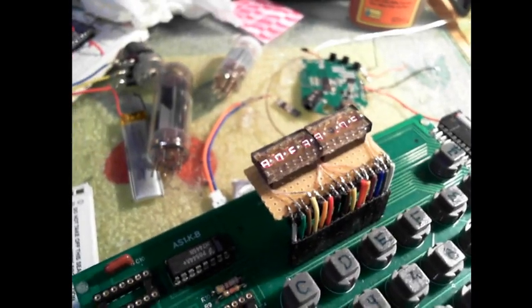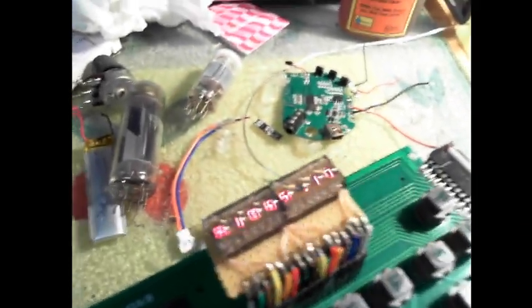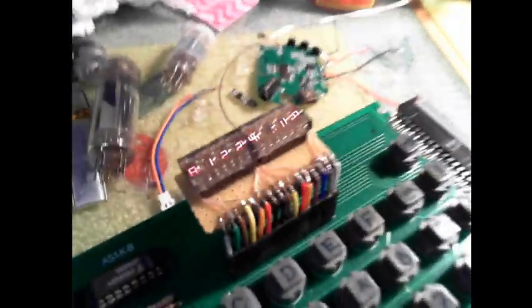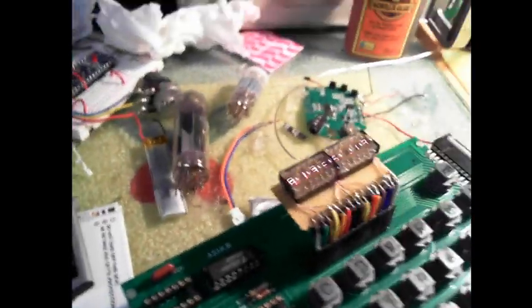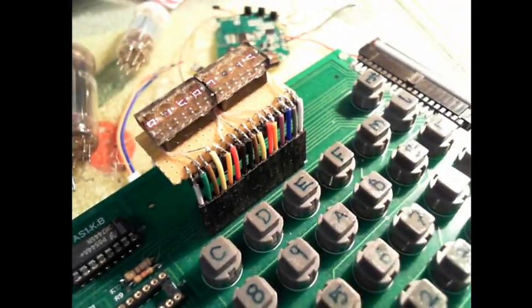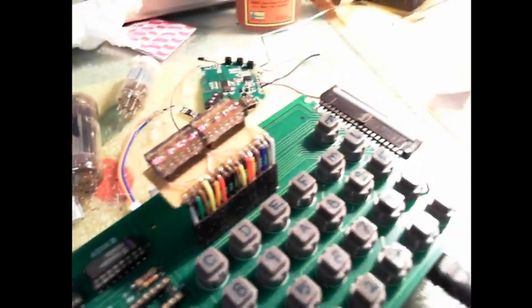And this is basically my way of obtaining an Acorn System 1, and I do want to do this for the Sinclair Mark 14 and other single board computer kits, which are basically non-obtainium, so I can still have them. They're just not vintage originals. And then for the interconnect, I just used a standard, I think it's a floppy drive connector. No, it's actually a standard IDE connector. I just grabbed one of those out of my part stock, sandwiched it in between, problem solved. That works beautifully, because it was just like, what kind of connector shall I use? Well, I'll just go into the garage, desolder some IDE headers off an old motherboard, and hey presto.